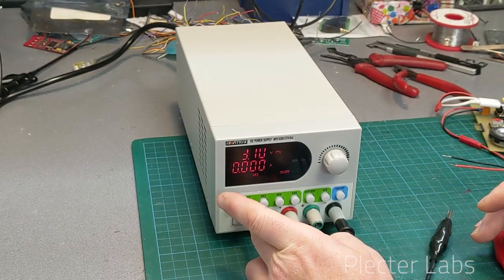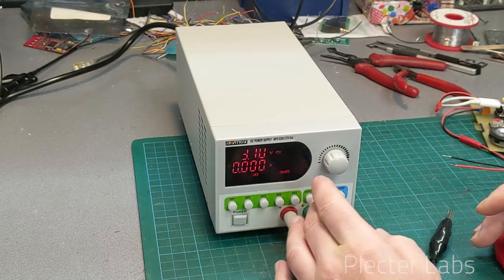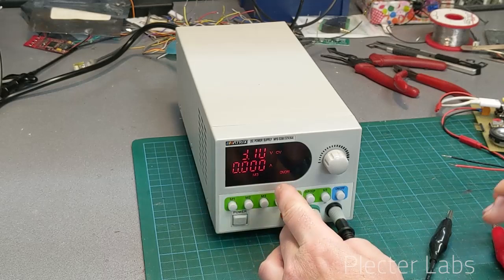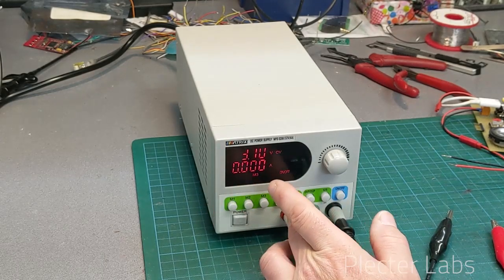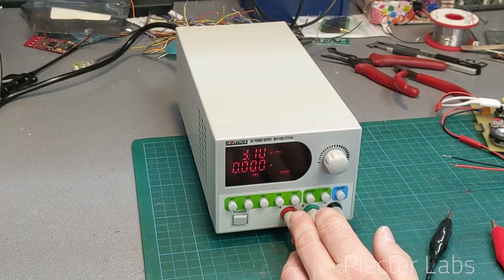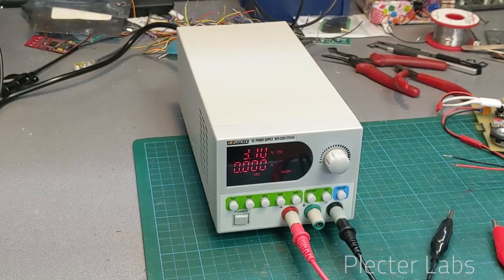With increasing current — so you have to be very careful about what you put in the memories. Otherwise you could move to something you don't want and suddenly apply more than 10 volts to the CFX, which is not something the board is going to like.